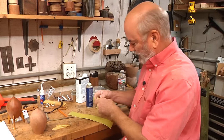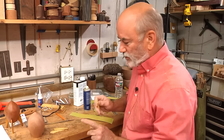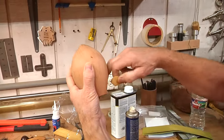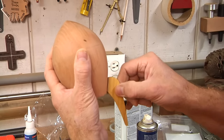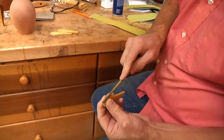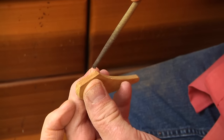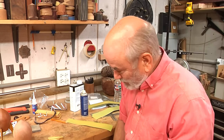I saved you from the fun process of sanding everything down — that's flat woodwork. The only thing I did want to show you was when this goes up here to mate, because it's a round surface this way. I'm good with the flat, but it won't touch on both edges — it'll rock. The trick I figured out was to take a rat tail file and just go back and forth until you dish this out a little bit, then it touches on both sides when you glue it. I'm going to work on my rat tail for a bit and then we'll be gluing it up.